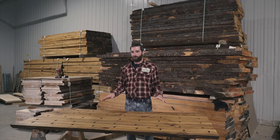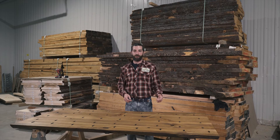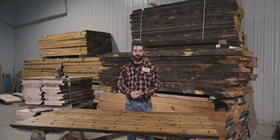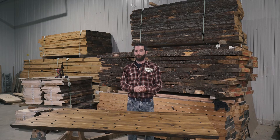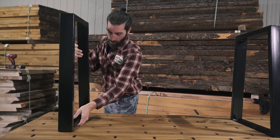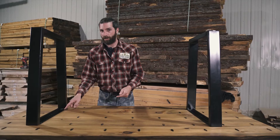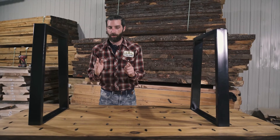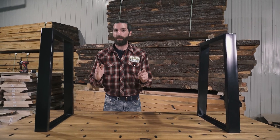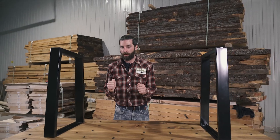To finish off this project, we're going to be putting on 28-inch legs. We've had these ones powder-coated black ahead of time to save us a little bit of trouble. On the outside here you can see that there are slots — what this allows is, with the seasons, it allows your wood to expand and contract without creating any tension from the screws in the metal, and still gives it that freedom, stress-free.